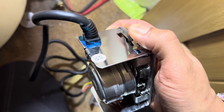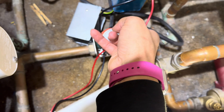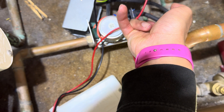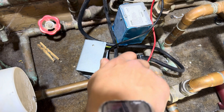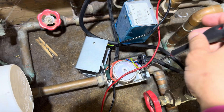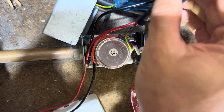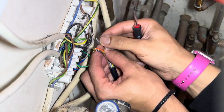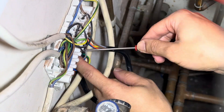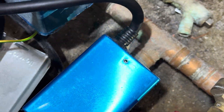I bought one of these in preparation. When I replace the zone valve, I always manually lock open the new one and the old one — it just makes it a lot easier to fit on the spindle and get your screws in. I would always suggest doing that — you don't have to, it just makes life a little bit easier. These are really easy to replace once you've done one. It's a bit of a fear going back into the wiring center with loads of wires. I like to replace one wire at a time rather than pulling the whole thing out — that way if anything else does come out, you can see where it's come from. Literally just like for like: orange out, new orange in; old blue out, new blue in; old earth out, new earth in. Then you won't have any issues with it.